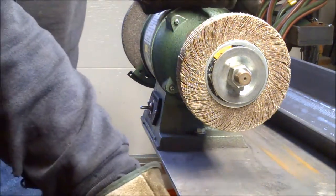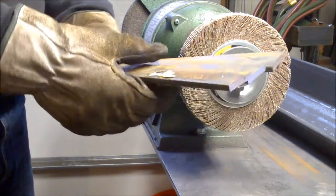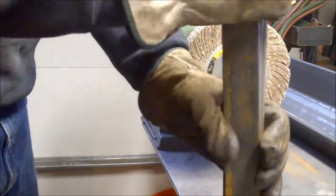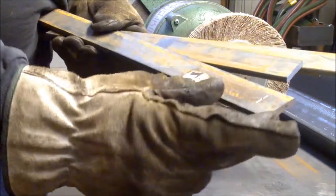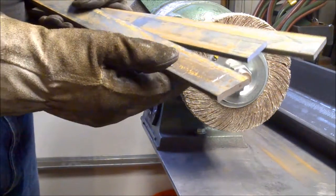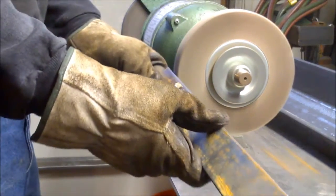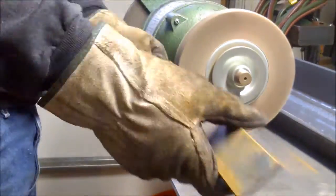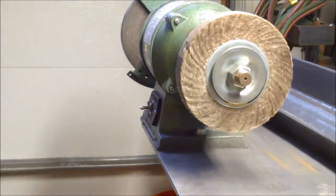Next up, working on the parts that will get a hole and be threaded for the 5/16-18. A little tip for deburring these: since this is all drop material I'm not concerned with preserving the lengths. I'm going to put them in the drill press, one hole for four parts. Rather than hold inch-and-a-half square parts on a flap disc, I can do it in a safer fashion using the built-in handle. Then I'll line them up and knock the holes through them to get ready for threading.